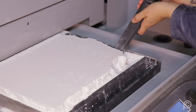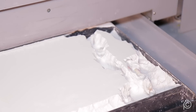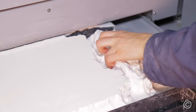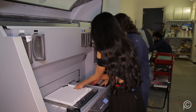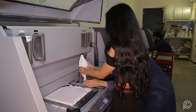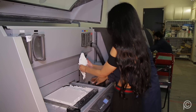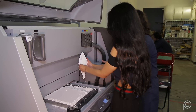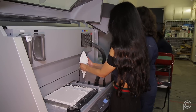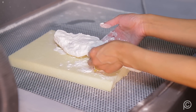First I'm going to find your feet — I feel like this is like digging for a fossil. Now you're loose enough to pull out — just lift it up vertically and I'm going to suck the rest of the powder out. Now you've got a heel, so it's a little fragile. Next we go straight over to the cleaning chamber. We place it in here and blow off all the powder. We have to be really careful if there's anything fragile — like glasses, a fragile heel, or fingers sticking out — it can blow right off. It's a really tricky part of the process.